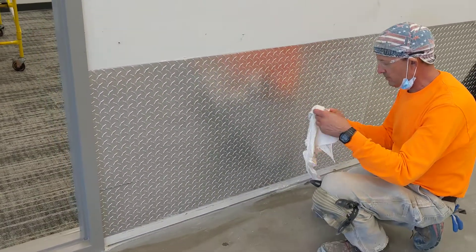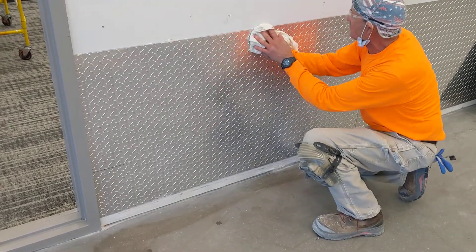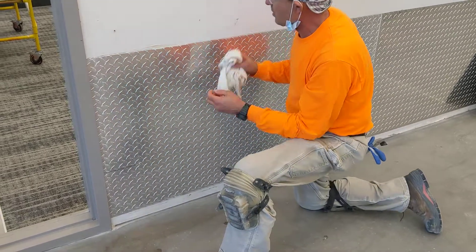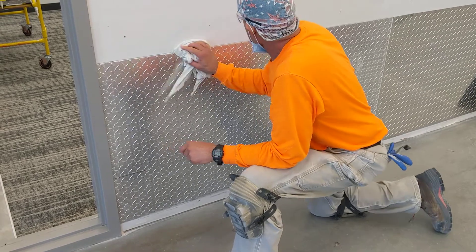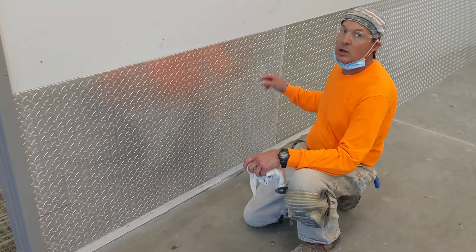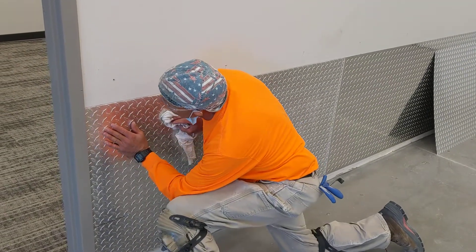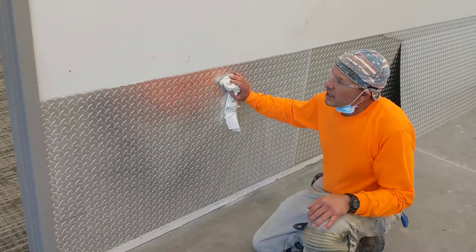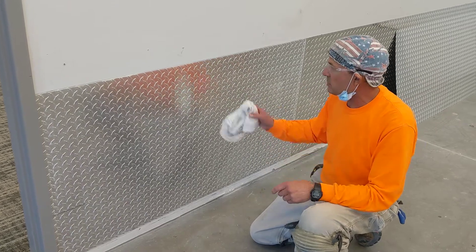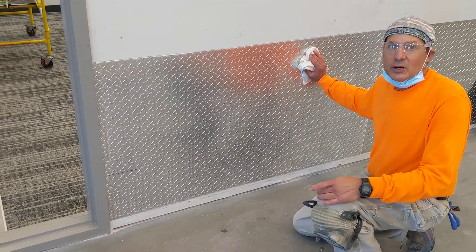You can also use rollers for this, but we don't have one — it could be helpful. It's down, should be pretty well stuck now. Because then you can kind of massage it into place — if it's a little off with the glue, you can kind of adjust it. It's not like a fastener where you're married to it. At this point, if you needed to change something, now would be the time. After the glue sets up, if they wanted to change something, you're pretty much going to be taking out drywall with it.